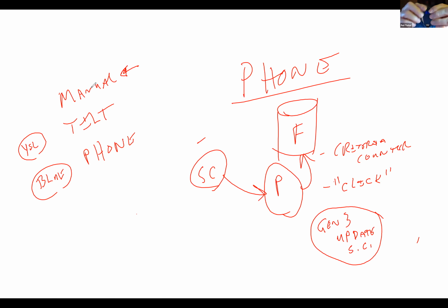And so I'm going to hold the rough button down, pressing and holding the rough button. And now I'm going to hit the right hand smooth button. The light is yellow. So I release, the light went out, I'm now in tilt mode. The way I know that is if I bump it, you'll hear the feeder fire.